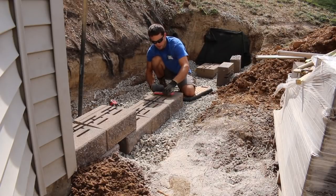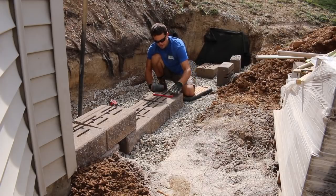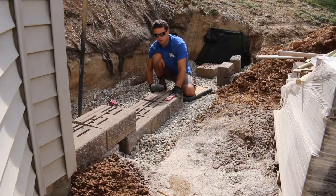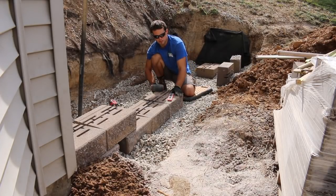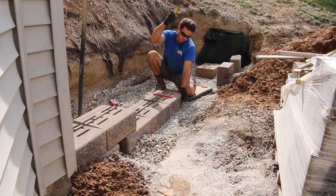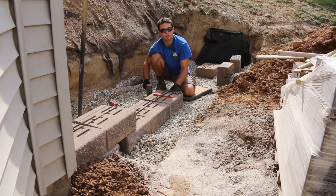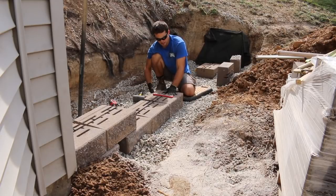You'll check your level — I've been doing it a long time so I usually start whacking on it before I check. I can see on this one the front side's a little bit high; the bubble's leaning towards the front. Side to side it's about dead even, which is what the transit is for — we go through and do that prior so we don't have to move the blocks a bunch of times. It's barely high on the front, so I'll hit it a few times. It moved a little bit but not quite enough, so I'm going to raise the back up, shove a little rock under there, and hit it a couple more times. We should be good to move on to the next one.